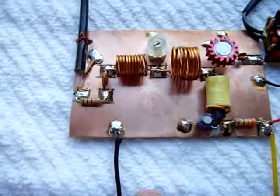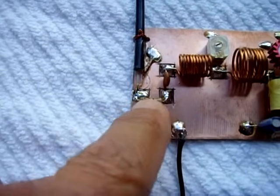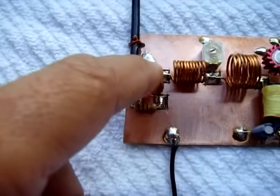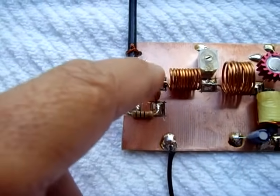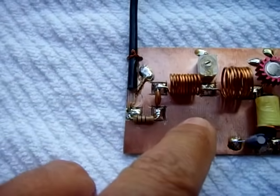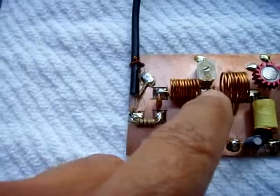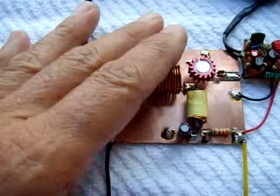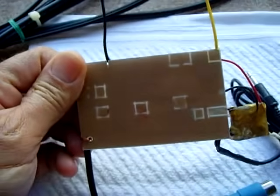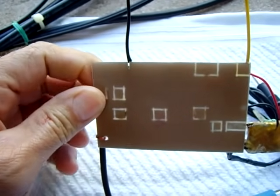It's a good idea to use this copper board. What you do is lay out each component on the board, then take a Dremel with a cut-off wheel and cut out each area to make little pads that are separate from the ground plane. So you cut a pad here, cut a pad there — cut all these pads — and this way the circuit can all go together. That's how I did it. You can see the back of it — see right through when held to the light — that's where I cut away the copper to make the pads.